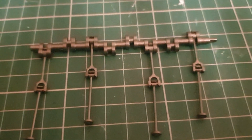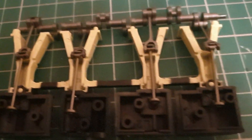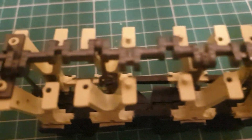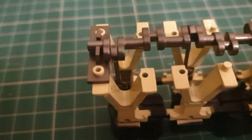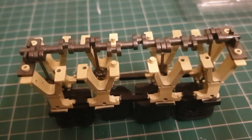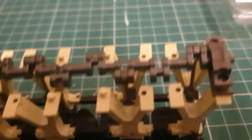We're now going to add that to one of the parts we made previously. These all fit into a channel inside each of these pieces and they should move freely when assembled. We've added two braces here and here to hold the crankshaft in place. Note that screw 3L is longer than 3M, so make sure the longest one goes with the fattest pin and the shortest pin gets the shortest screw. We use two plates here and that's screwed the whole thing into place — it's now holding nicely.